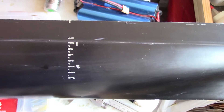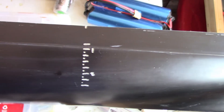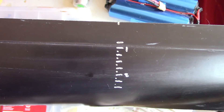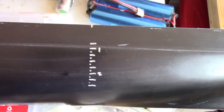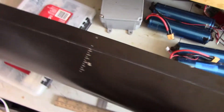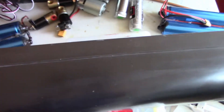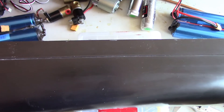I've scribed some draft markers on the hull — pretty much just the distance from the top edge of the hull down. I have marks at one inch and two inch, with bigger marks at the quarter inch and smaller marks at the eighth of an inch. I have those along the hull: some in the stern, some kind of mid-stern, mid-bow, and at the very bow. When I float the hull, these will help me figure out how the draft changes at different points along the hull.